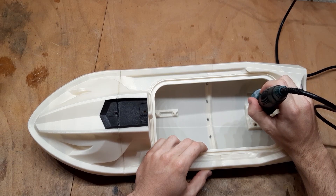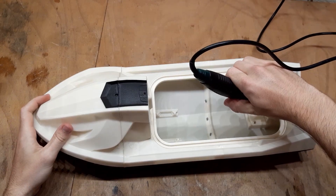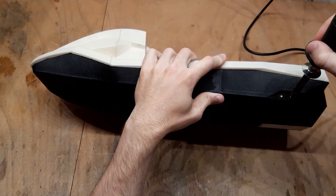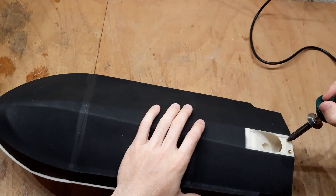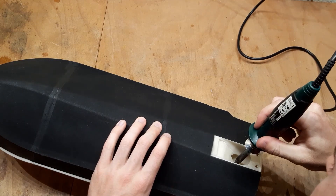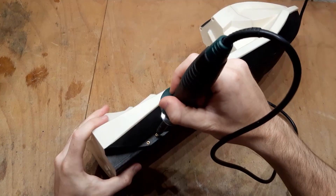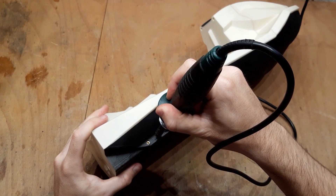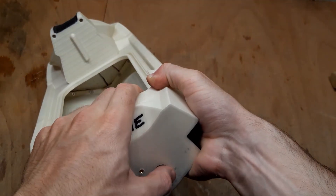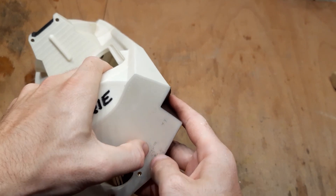Now here comes the pump assembly. This is the same as in the MJ35 build video, so if you need to see this in more detail, please watch that video — I will leave the link in the description. In addition, I am also using threaded inserts to hold the turn fins, though during testing we found out that the turn fins don't work as nicely as on my 4G sprint hull. Anyway, the mount is there and you can use it or you might not. During the pump assembly, just pay attention to the seals — you might need to enlarge the slot a little bit, because of a fat first layer. Just be careful not to damage the seals.